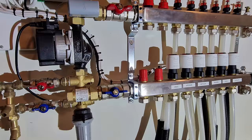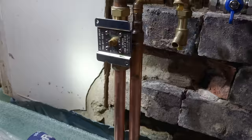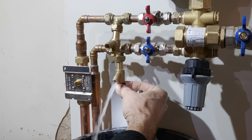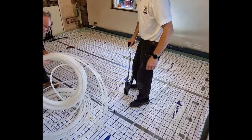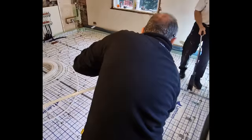I fitted isolating valves at the manifold end — you can never have too many — so I could fill the flow and return pipes and check my solder joints under the floor weren't leaking before filling the underfloor heating system. The zone valve for the underfloor heating went onto the flow pipe, and on Jim's advice I added a bleed valve to purge as much air as possible before opening the manifold isolator valves. With that done I laid the final Laminon membrane and the final heating circuit — big thanks to Martin at m4r.co.uk for dropping by to help.